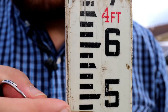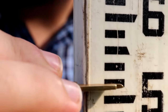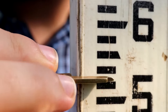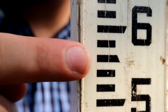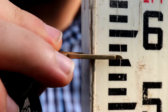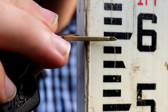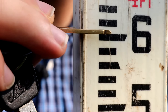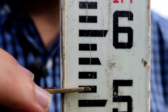Knowing you're at four feet, you figure out the tenths and hundredths. If the reading comes right at the top of the line, the reading is 4.50. If it comes in at the bottom of the next line, that's 4.51. The graduations continue: 4.52, 4.53, 4.54 — then 4.55, where the slightly longer line indicates the halfway point — then 4.56, 4.57, 4.58, 4.59. The bottom line of a number grouping is the .09 reading. If you get a reading in the middle and it's hard to judge, always make the assumption that it's lower. That's all you have to do to read this rod.